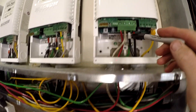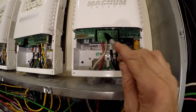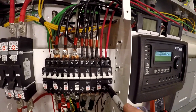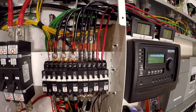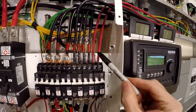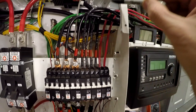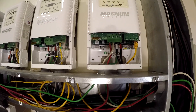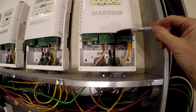The PV negative — the white wire — comes in and goes directly into the PT100 on the PV negative input, right here. The PV positive — the red wire — does not go directly into the PT100 but comes over here to a breaker so we can break that circuit. It's a 300-volt breaker at 50 amps; it'll probably actually run about 150 volts. It's on the plus side, and coming out it goes right up into the PV positive input.